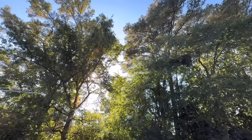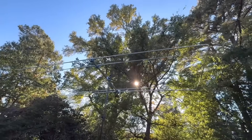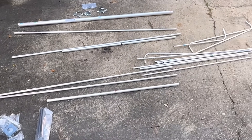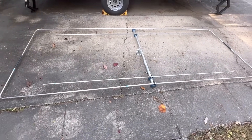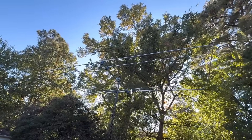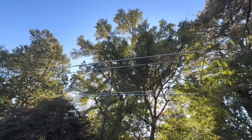It is a beautiful fall afternoon, and here's the antenna — the MAMO beam, Italian-built, exclusive for the ARRL. I'll put a link below if you're interested. It took me about 45–50 minutes to put it together the first time. It is a portable antenna — you can buy it for portable or permanent installation. I've got it set up portable with wing nuts so you can take it apart. My advice: keep the center parts together, pull the elements away, pack it, and go. You could probably get it up in 15 minutes.